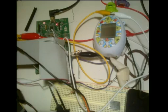Yeah, that's pretty much what I did. Actually, let's see if... Do I show it very well here? Probably not. What I did is I took out the pins that you connect to. So I pretty much cut this piece of plastic off, and I took pins out, and then I attached microcontroller pins there. And then I used the light figure, which is just the jumper, and I slid it on, and because that one doesn't have a ROM in it, it took the data from the microcontroller board. Although you could also do it, since it's actually just a jumper, by just putting down a piece of wire so it's connected, and that would make it work too.